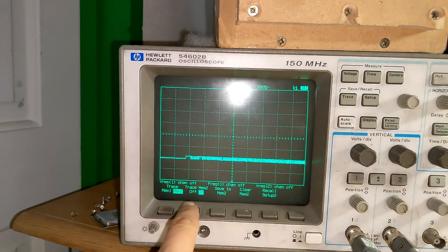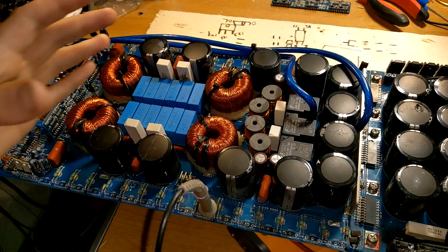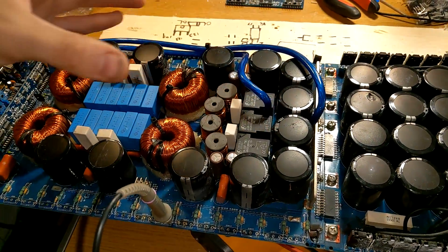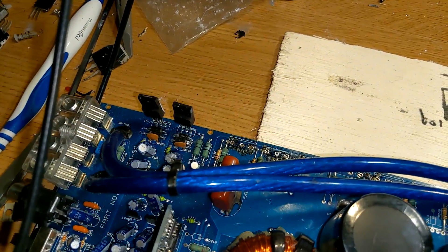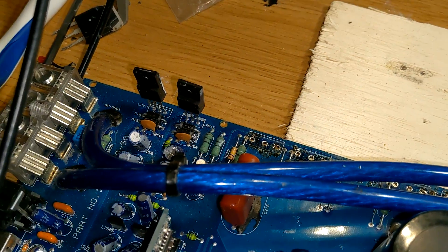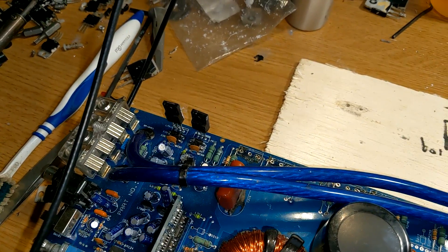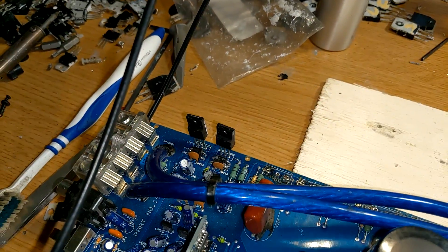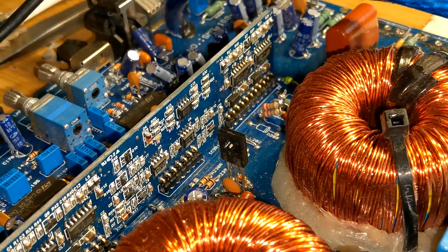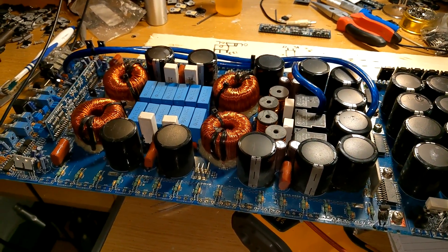Compared to trace memory 2, this is completely resolved — there's no more of that bump. Like I said, it causes all the FETs to turn on at the same time, puts huge stress on the FETs, and some of the rail voltage in the caps gets dumped through the FETs while they're all on together, causing the amplifier to fail prematurely. These resistors add some fusible current limiting to the voltage regulators which is simply not required — many amps don't have this at all. My recommendation is to jump over these resistors and give full current supply to the PWM generation circuit so it turns on before the drive chips get a chance to send a bump down the low side drive. Hope this has been interesting — leave a comment if you have any questions, thanks for watching.